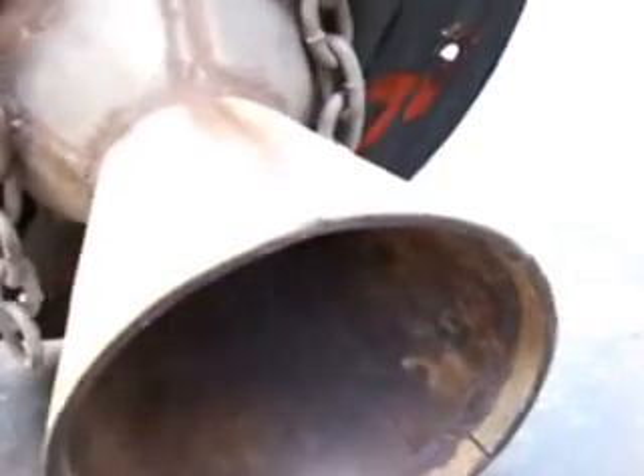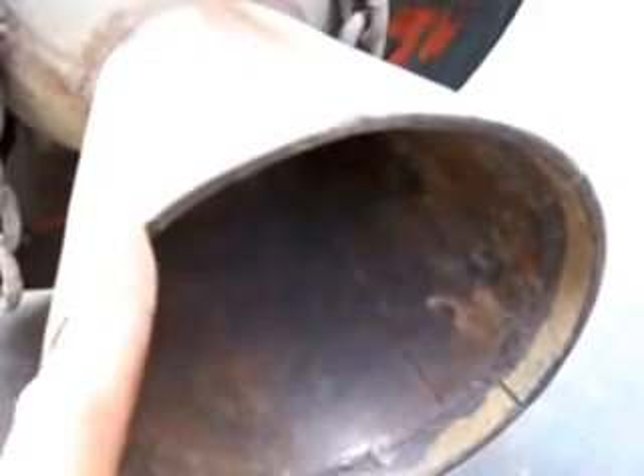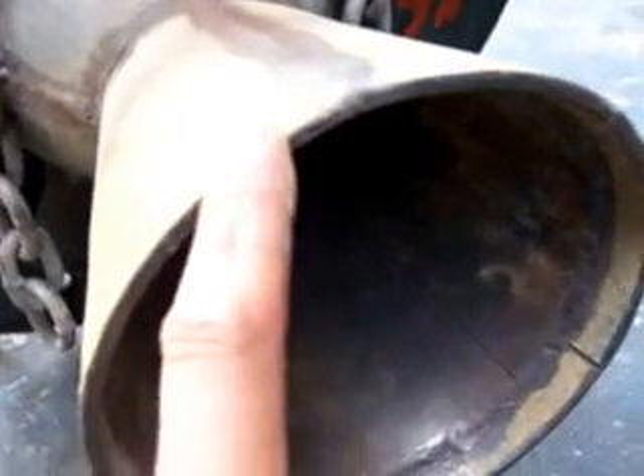I had to make this cone out of three parts. Reason being, because I've used such thick steel, there is no way to roll it in one section. I found it easier to make three parts and then run stitches and a full weld all the way around to seal it up. So it's fully lined from bottom to top with three-millimetre stainless, and the outside is six-millimetre galvanised pipe, which gives you nine millimetres — or about three-eighths of an inch.